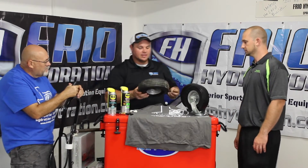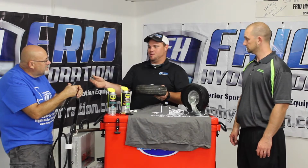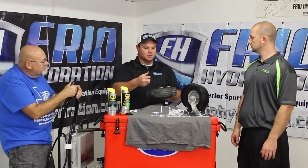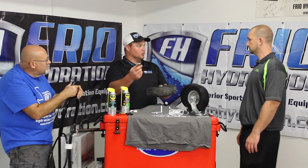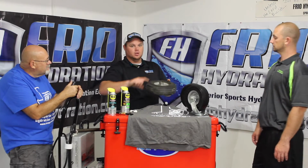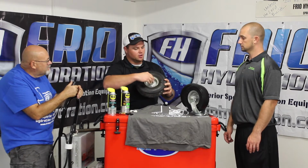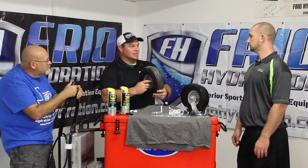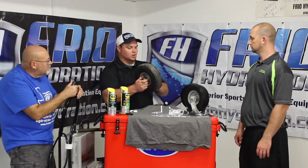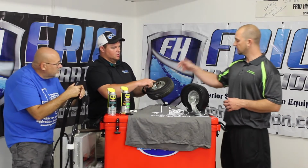And one thing that I do when I'm replacing my bearings, and this is something I learned from Dad and Grandpa working on the truck way back in the day, is we pack the bearings. We'll take a tube of grease, and we'll just fill this whole interior portion of the wheel with grease. Then when we insert our new bearing here and we tap that back on there, this thing is packed with grease. You want to pack your bearings with grease at least once a year. All right, so remove the bearing, pack it with grease, grease it regularly.